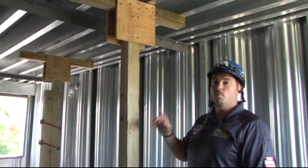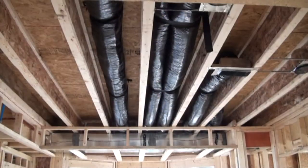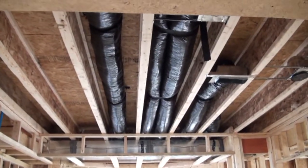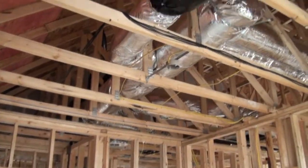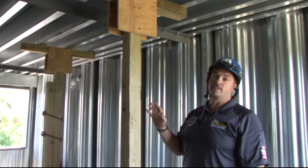It's a maximum of three feet wide. One of the critical things about this shore — one of the options we have — is if the floor joists run one direction and our roof rafters run in a different direction, it's acceptable for us to twist the shore so our header goes one way and the sole plate goes the other direction. That's completely fine.